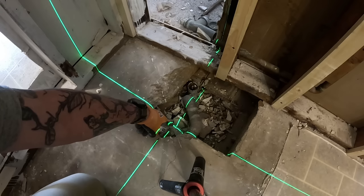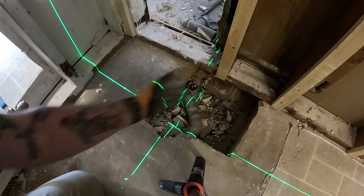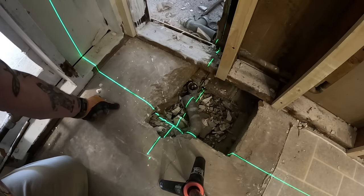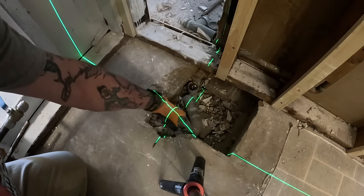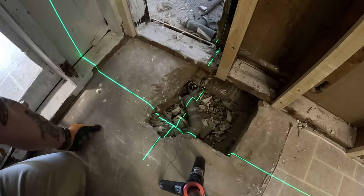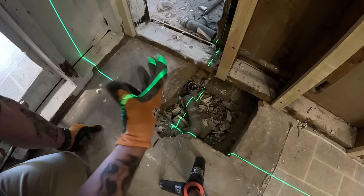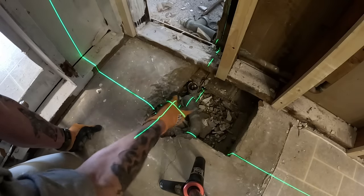Because this is the drain on the P-trap on the tub. So you gotta see, I go back, and then it's gonna have to make a sharp turn. Yeah, so we'll probably end up whacking this off and go PVC, and we'll just build us a PVC drain for this, because if I make a trap, I can make the quick turn and all that.